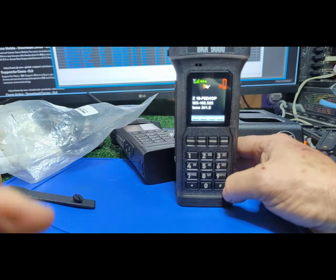You could set your max volume and minimum volume on these. I've got the minimum volume set for firefighters so they can't turn it all the way down — I think I have it at one or two. The volume on these is just super, super loud — even up just that much. I've got a maximum speaker adjustment in the menu so I can attenuate the speaker when I have the handheld speaker on, so I don't blow out the little speaker in the hand mic.